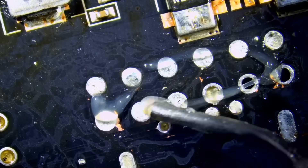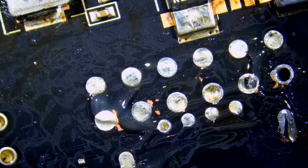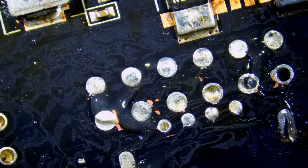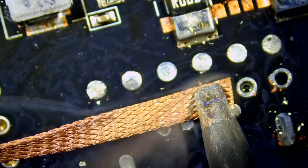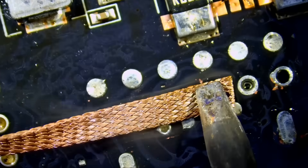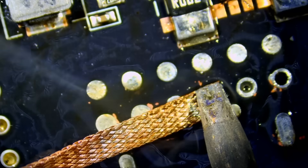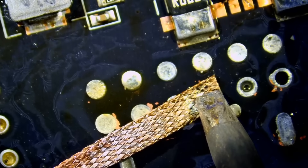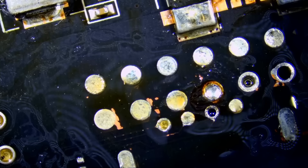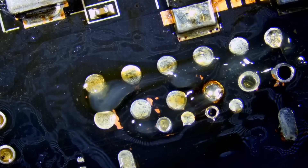It's going to be hard to desolder the holes, as mentioned in part one of the video, because the board is very thick with a lot of thermal mass. We're going to apply low-melt solder even though we have other solder on the board. Let me demonstrate — I have my soldering iron at 450 degrees Celsius and the board is still hot, yet the hole did not even flinch. The board itself must reach the melting temperature of solder. So let's apply flux — flux helps with the flow of solder — and then apply low-melt solder.